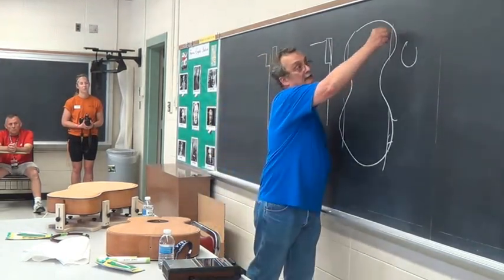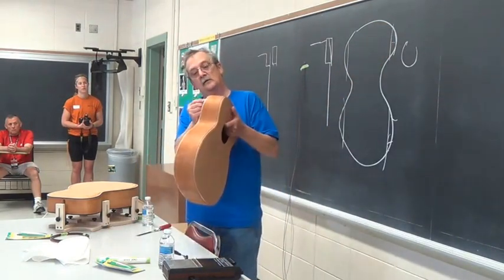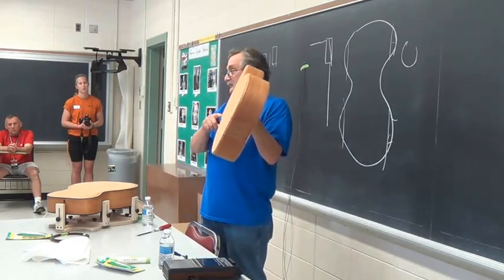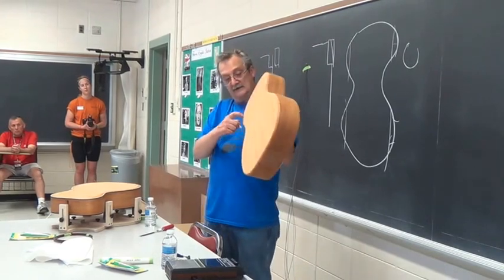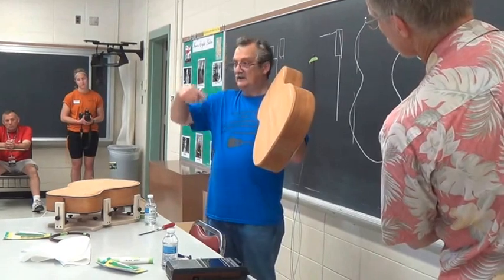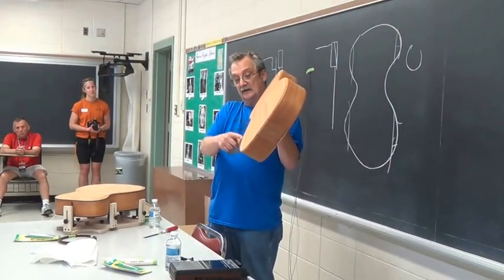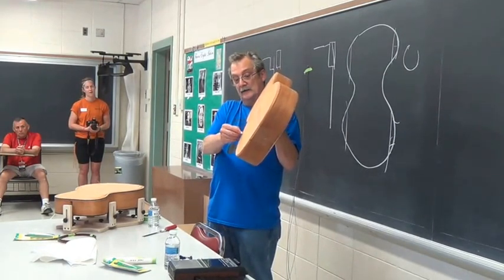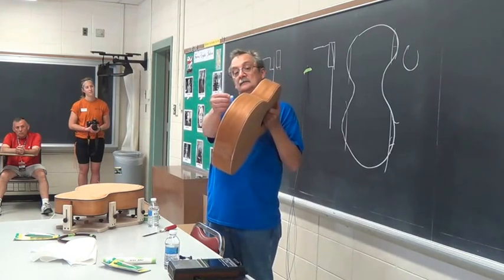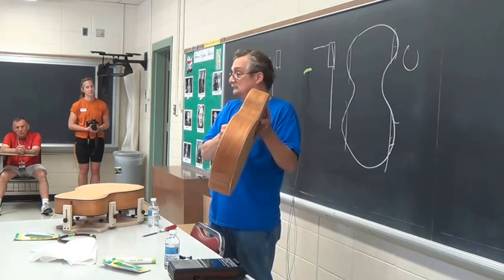So I'm going to climb cut about an inch in. Basically, there, to there, and to there. That way, I have grain support when I come across. Right here, that's just your critical point. Then once I clear that out, I come in here and nibble into the waist. Once I know I'm at the waist, then I can climb cut back this way, and I can route cut this way, all the way over to here. Then I'm going to do a little bit of climb cutting in here, and then I can route across.